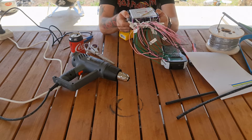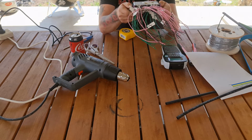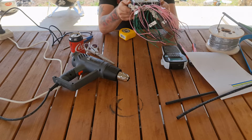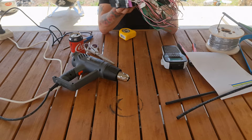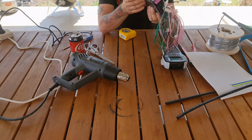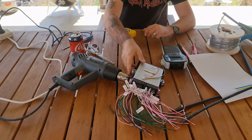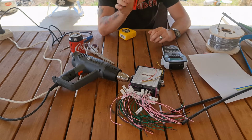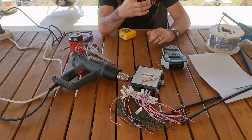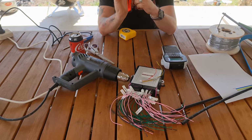into here, and boom, I've got 12 mounts on this side to disperse the weight of the 2 on this side. So that helps me stop this from tearing free in the event of an accident or just hitting bumps in general driving. So yeah. Anyways, if you want a good set of cutters, I recommend this style because it allows you to strip your wires up here, cut your wires and crimp terminals on.